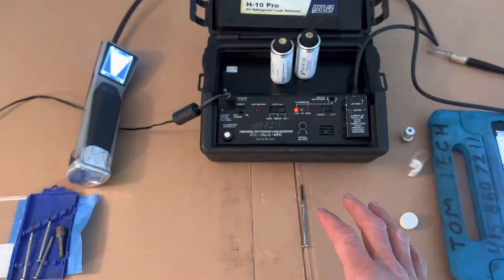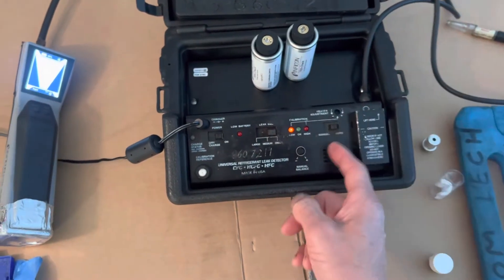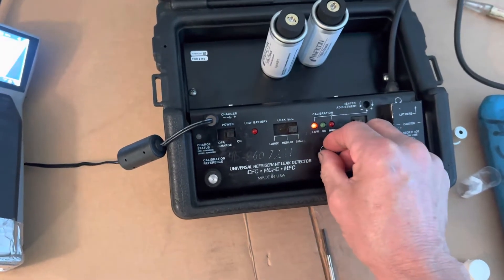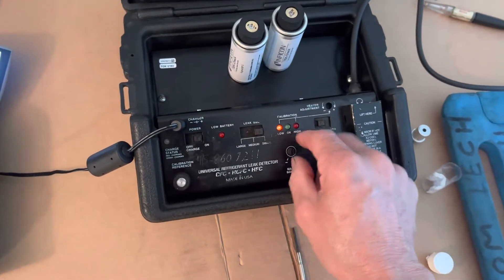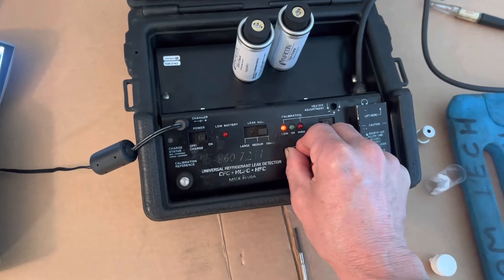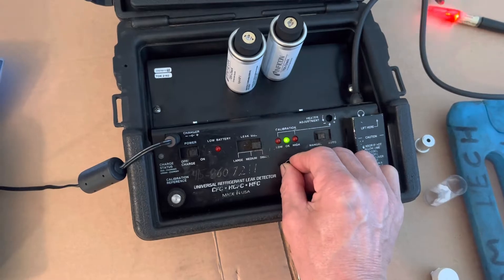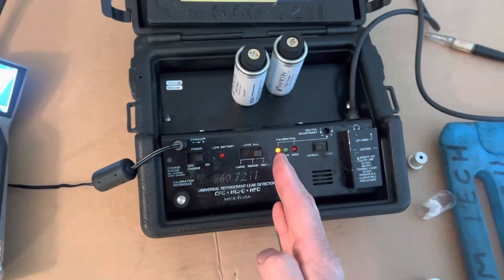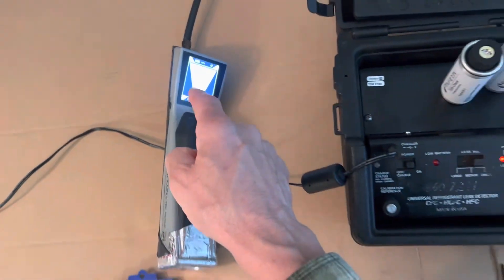We now have the brand new sensor in it. I'm going to put it from auto mode into manual mode — manual mode is more sensitive than auto mode. Let's turn it all the way down; it's in the smallest leak detection mode right now. Let me calibrate it and turn it up. You want it so it's just in the red before it goes into the blue, and it'll say like three beeps a second. When you're calibrating it's one beep a second — too much. This is why guys don't like the manual mode because they don't like the always-continuous beeping. I'm going to come down and get it out of the green right there. So now I'm in the low range and in manual mode — this is the most sensitive mode, super mode.